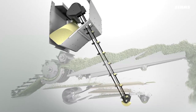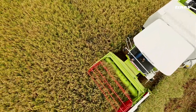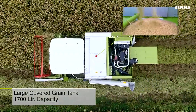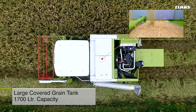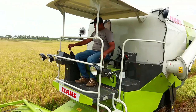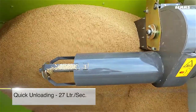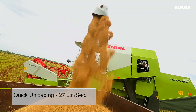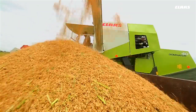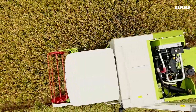This enables the machine to efficiently handle high yield varieties with excellent grain quality. The large covered grain tank has a capacity of 1700 liters, ensuring continuous productive running hours over a longer period of time. It is equipped with a quick unloading system that unloads at a rate of 27 liters per second, ensuring that the entire unloading operation is completed within one minute.